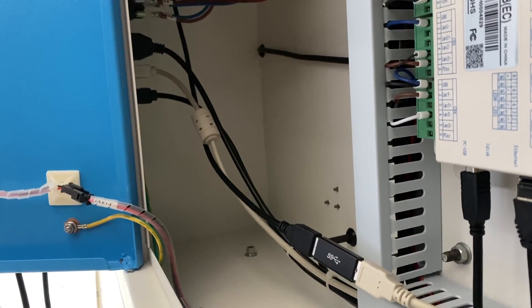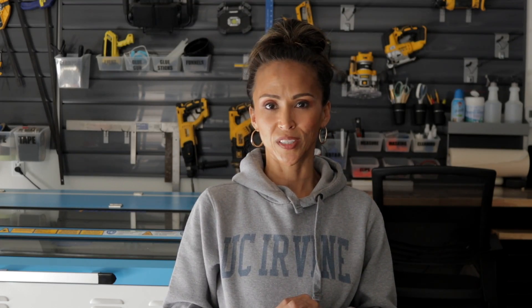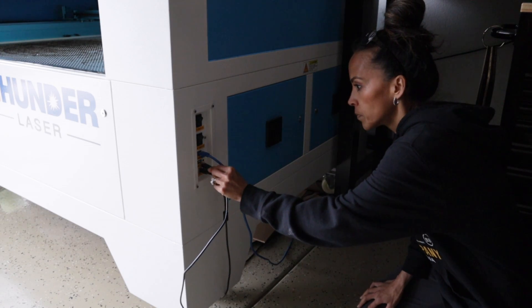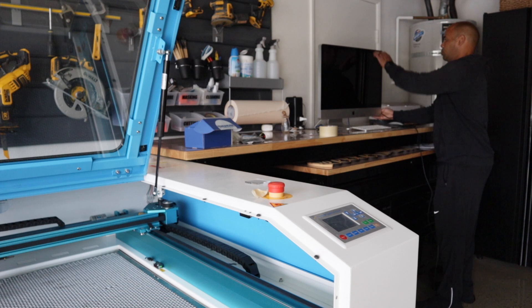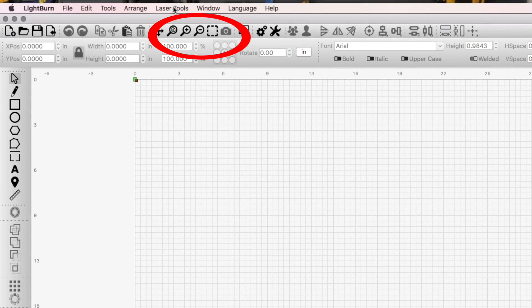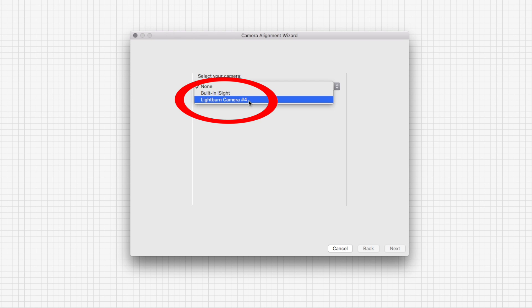This is how it should look. Next, connect the laser to the computer — just plug the USB cord that the camera came with, or a longer one like we had to get, and plug it into the laptop or your computer. Now we just need to get the camera set up in Lightburn, which is the program that runs the laser. When you open Lightburn, go to Laser Tools in the top menu, then Calibrate Camera Lens. When the little screen pops up, you should see an option for your Thunder camera.